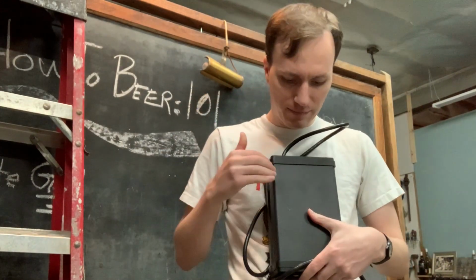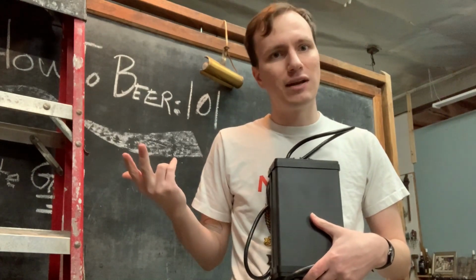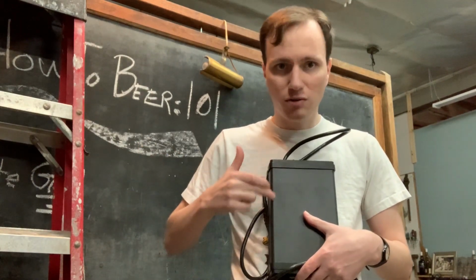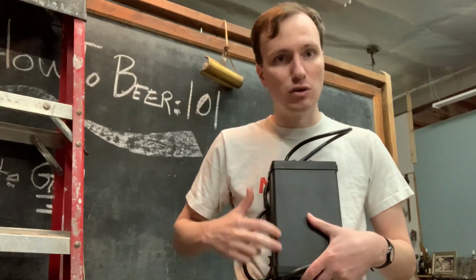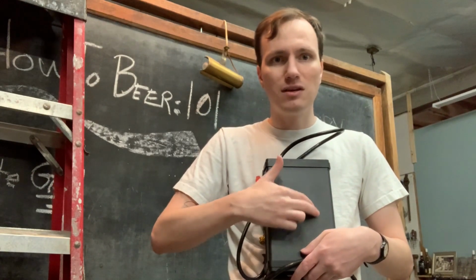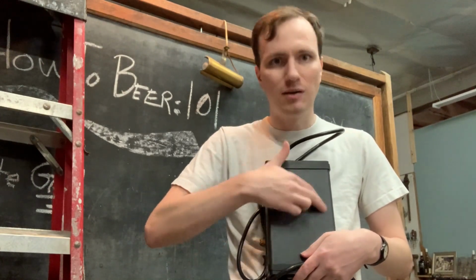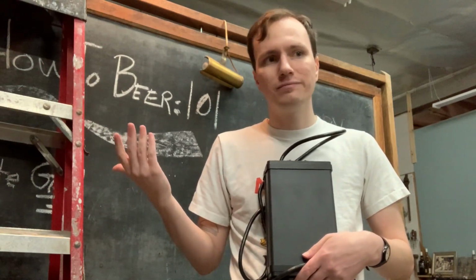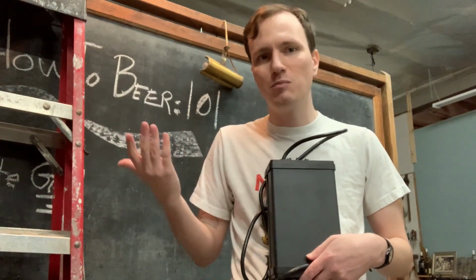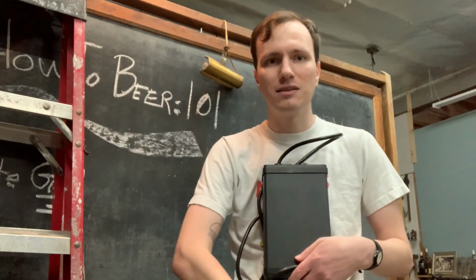Inside, you've got a rail over here, because I think it's an easier way to set up the box, and it's what they do on larger systems. So you've got power, positive, negative roughly, and then neutral on this side, and then you just route out. The back of here is where the end of the EZboil is, and then you've got the SSR up here, and the sensor goes to the thing. You get it. I could post a schematic online, but you get the gist.